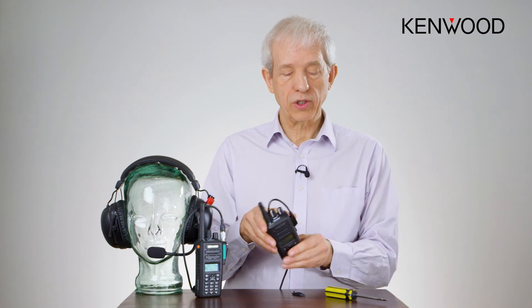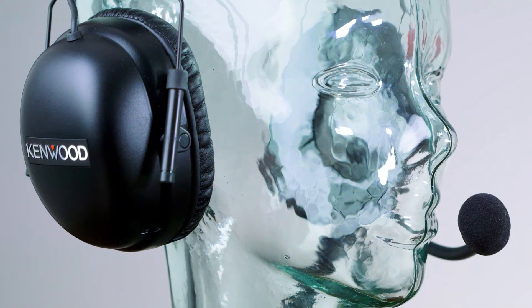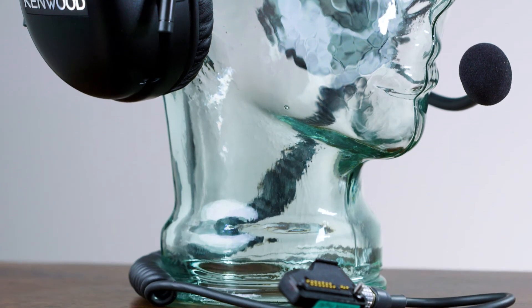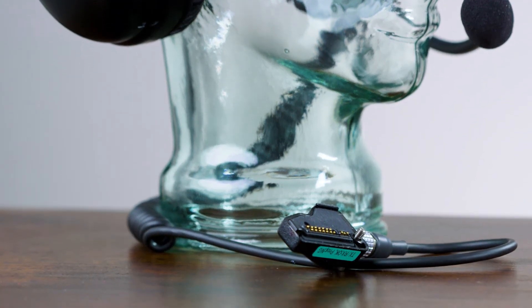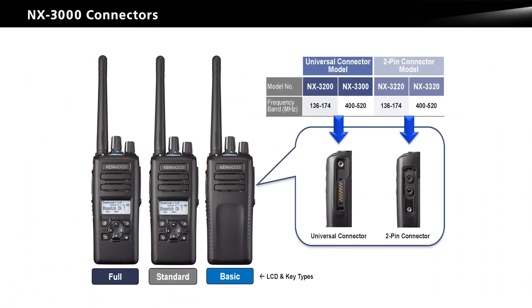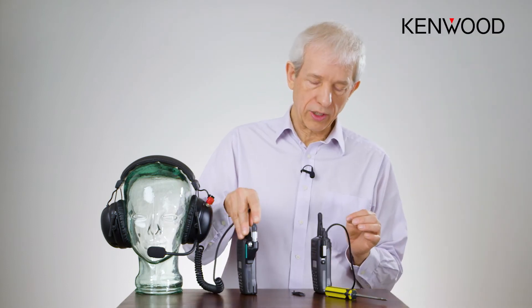Accessories are much more readily available and at lower cost for 3.5 and 2.5 millimeter connectors. When selecting radios, the main concern is whether the user will be adding and removing connectors while in a wet condition. If they're outside and need to switch between headsets, handsets, covert surveillance kits, or any other accessories while it's raining, then you really need to go for the systems connector.